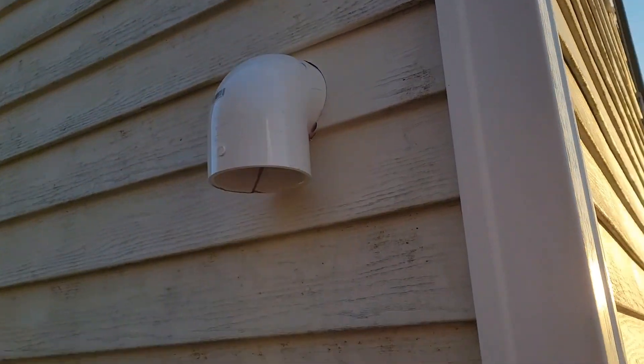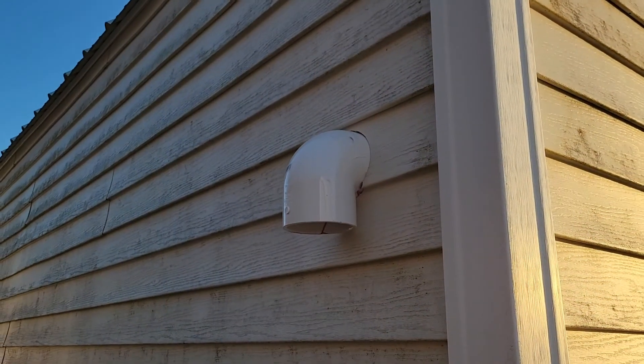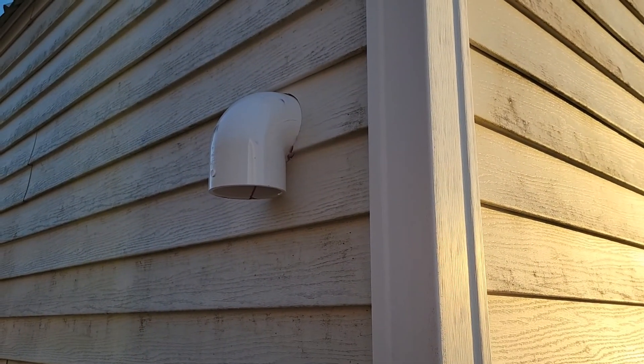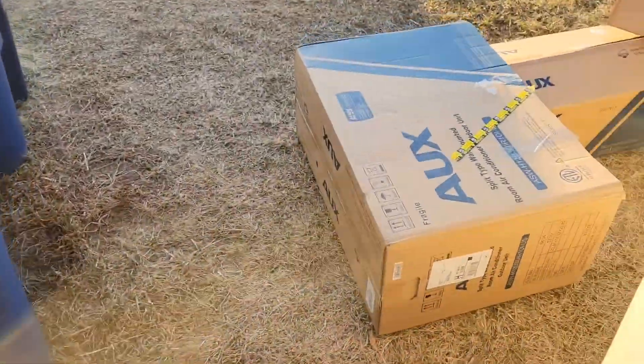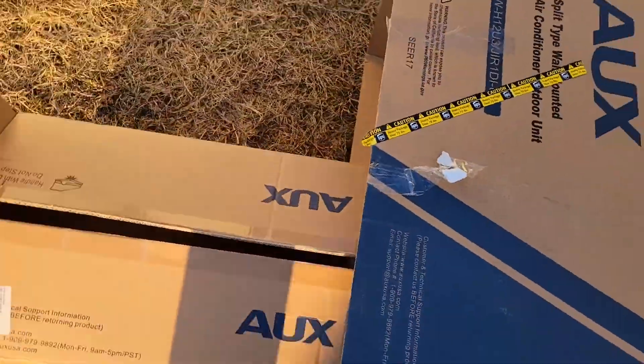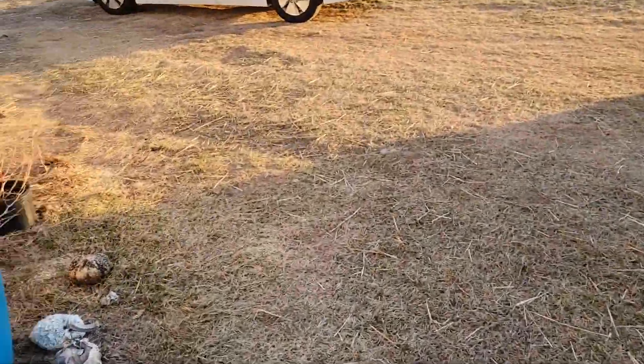With the piece in, looking at it from the outside it looks quite nice with the pipe underneath. We'll run some caulking around the top and underneath. The hole size is pretty close to what we needed — I matched up the hole saw and got about an eighth-inch reveal on the four-and-an-eighth-inch hole. A caulk bead there should seal it with no issue. In case you're wondering, the brand we're putting in is an AUX split-type wall-mounted AC unit with a heat pump.